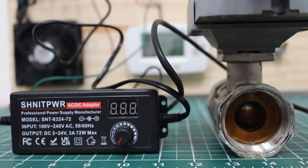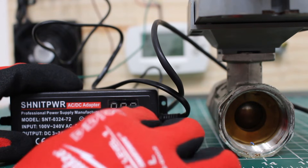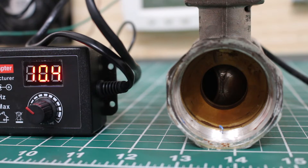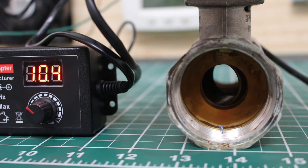Let's pay attention to the valve — my power is now on. I'm going to set this to 10 volts DC and we're going to watch it open. We're at 10.4 volts DC — you can hear the actuator starting to open. We are about halfway open and it's going to keep going. We are almost fully open. So 10 volts equals fully open.